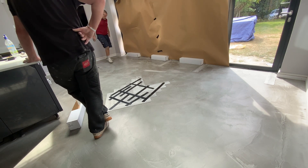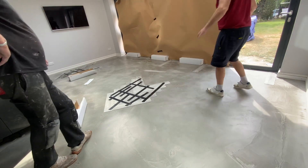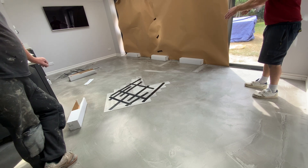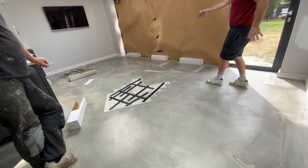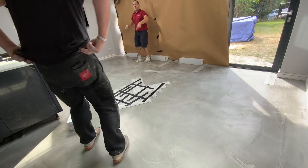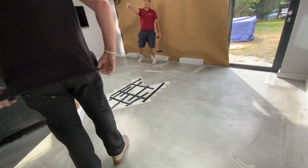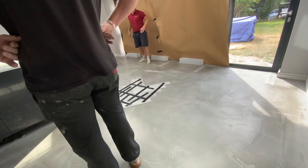That gives us a square line, because the pano doors are going to be the main focal point. Almost every line is set off square from the back. If the wall is square here and you set a line in square to the back, then you take all your measurements off that datum line — it will keep everything square with the back wall. It's only because we can't get a measurement right the way up there, so most measurements will be taken from here.